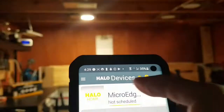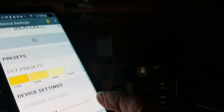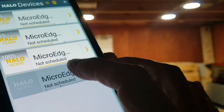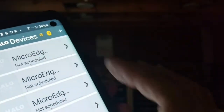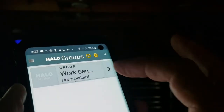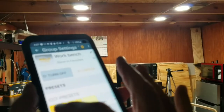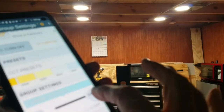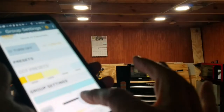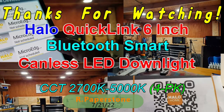Let's try the app out and see if my wiring is good. Wow, look at that — pretty neat! This is where I am operating the downlights in individual mode. As you can see, I can turn them off and on and adjust the color temperature of each lamp separately. Next, we'll go into group mode where a single command operates all four downlights at once. I just changed the color temperature, and now we're going to dim the downlights and brighten them back up — all in unison. It's good to know that, electrically, my installation is good. Thanks for watching, and I hope that you found my video helpful.